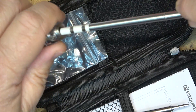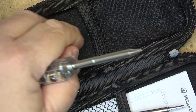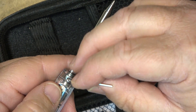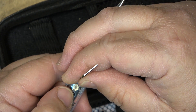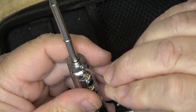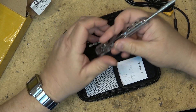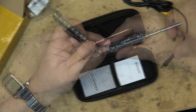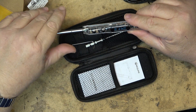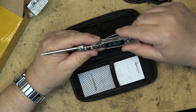Let me plug in this other tip. It can be secured — if you want to secure the tip in, you can put a little set screw into the front of it here, and this will hold the tip in place. To power the iron up, it'll take anywhere from 12 volts to 25 volts. We're going to feed it with 20 volts. It's off right now — it tells me on the little display it's on 20 volts, and the tip temperature is now set for 300 degrees Celsius.